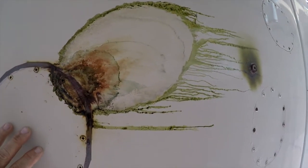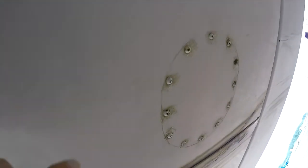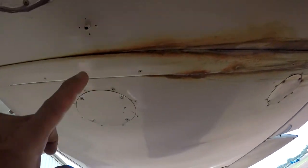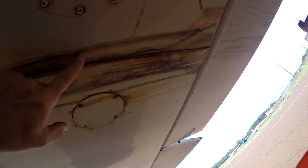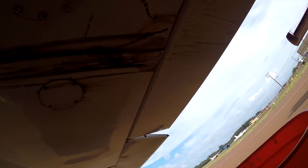But this isn't the biggest worry. One of the problems is that the access panels have pan heads on them, not countersunk. But if we look right here, we have a lower spar outboard rib leak, and this one is so bad you can actually see the fuel dripping off the wing into this bucket we're using to catch the fuel for the owner. You can see the staining on the back of the flap — this is quite a bad leak.